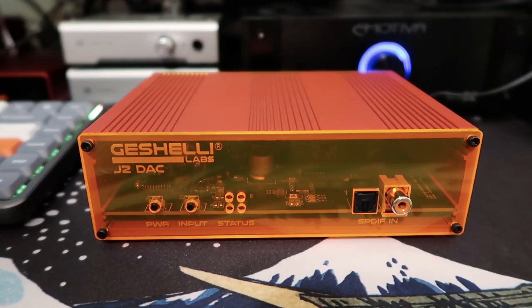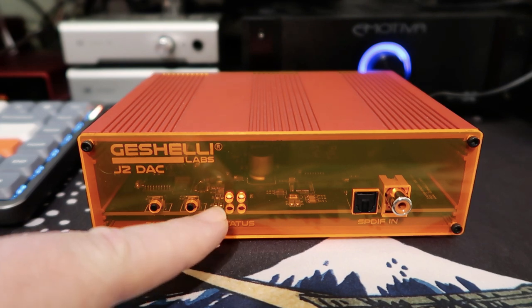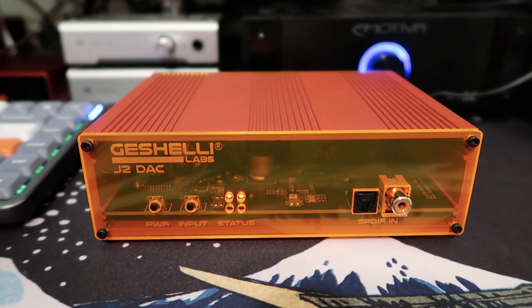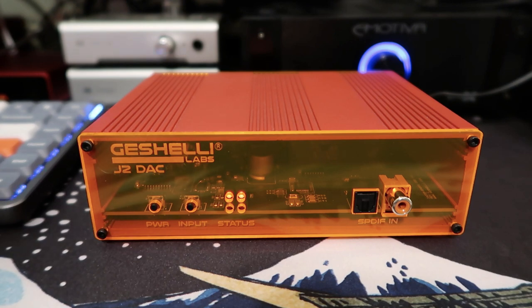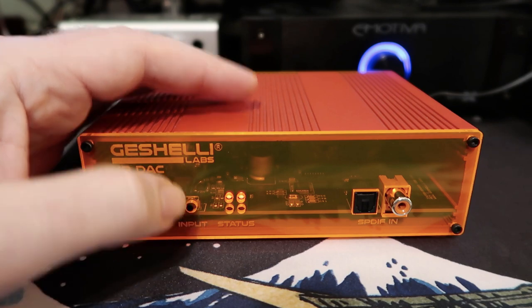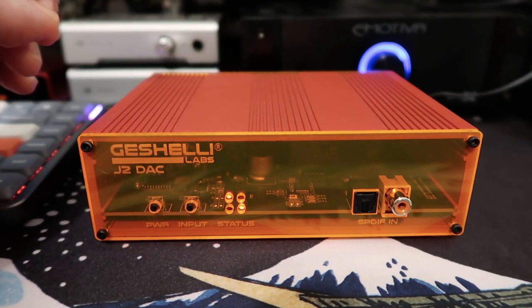The J2 is a pretty simple device. We just have a couple of buttons on the front panel. The left one turns the power on — you'll see it lights up and there are some status indicators. The top left indicator shows power is on. The bottom left is a DSD indicator; the DAC does support DSD, but that's not something I'm currently using. The other two lights on the right indicate which input is selected. There are a total of four inputs: two TOS link and two digital coax, with a pair on the front panel and a pair on the back, and you use the input button to cycle through them.